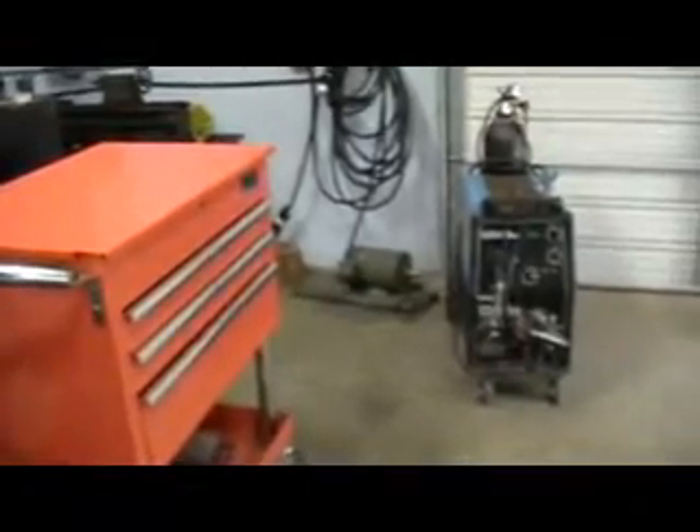These converters will run, as a general rule of thumb — there are definitely exceptions — but will generally run twice their horsepower when loaded, meaning while the machines are actually cutting metal, not just idling. It will run twice its horsepower like that and will start anything from its horsepower and down. For instance, that machine has a 2 horsepower motor, that one has a 2 horsepower motor — a combined total of 4 horsepower — and that motor would have no problem starting those simultaneously.